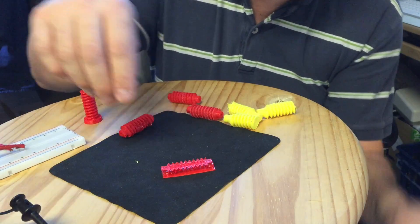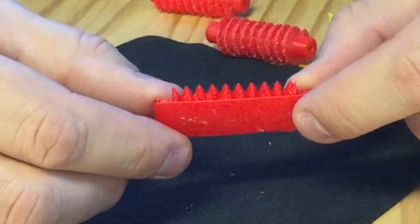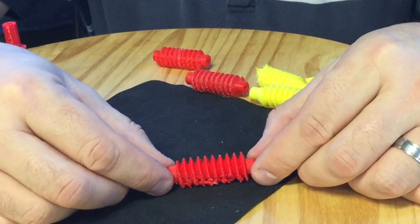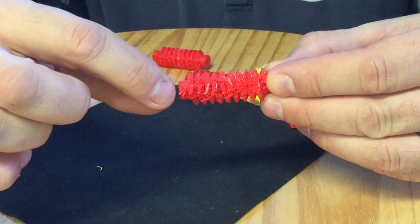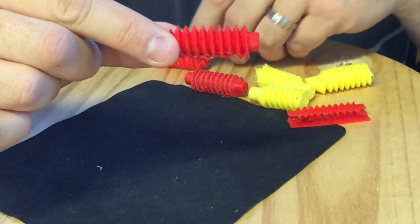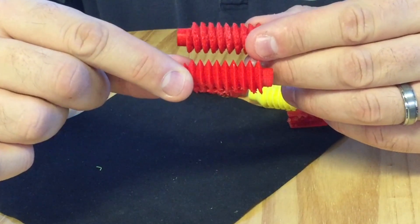So then I said okay, I'll lay this on its side, and I built a little platform for the gear to sit on. Some of the teeth just broke away, so I could tell that wasn't going to work. Then I tried printing right on its side with supports just underneath, and it looked really good on top — nicely triangulated — but on the bottom it was a mess. But I was encouraged to see the top of this gear was really, really clean. When I compared it to the previous one, so much better. So I knew I had to do something different to get a better gear.